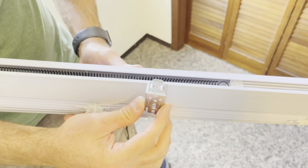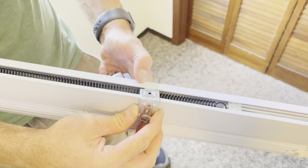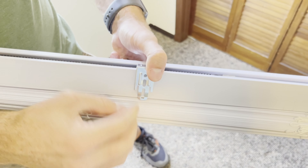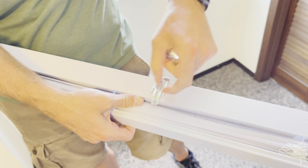These are the brackets that come with the cordless blinds. The short side is the top side, and the long side with the little clip at the bottom is the back side. The entire bracket will be hidden by the blinds once installed. There's a little nub that sticks out and fits down on the inside, and when you shove it in all the way, this part at the back clips on underneath — so when you push the blinds onto the wall, it snaps on.